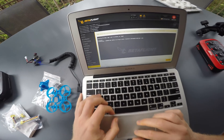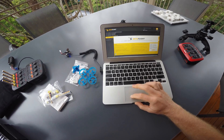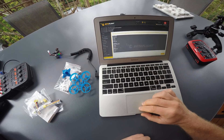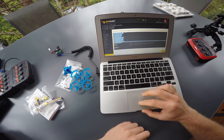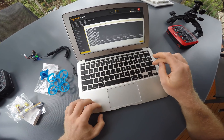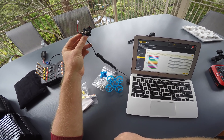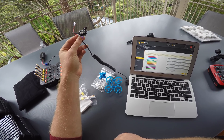Connect the board and go to the CLI. The first thing you want to do is type 'version' and look at what it gives you. At this point you need to decide if you want to update the firmware or use a configuration file for that specific firmware. If you want to update, the process is very simple — select the version you want, click download, and then click flash. This will install the latest firmware onto the flight controller and now you still need to give it some specific settings for this board. You get these settings by clicking the link in the video description and then copy them into the CLI, type 'save' and hit return. This saves the configuration to the board and then you can disconnect and move on. If you ever have problems with the connection between your transmitter and the model, you can connect it back to the computer and use the status information here to start troubleshooting — makes it a whole lot easier.